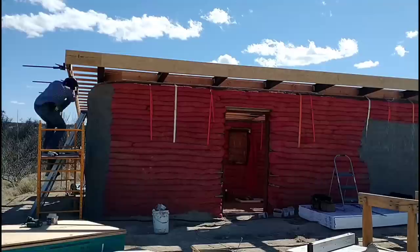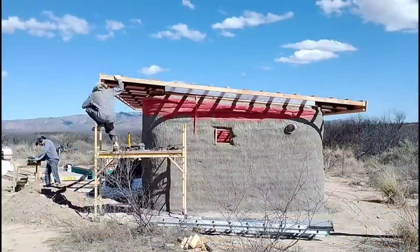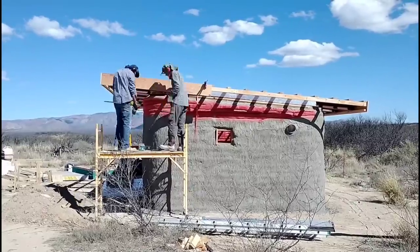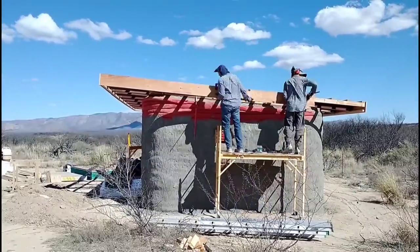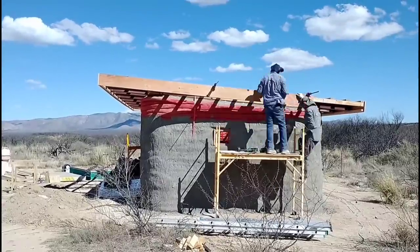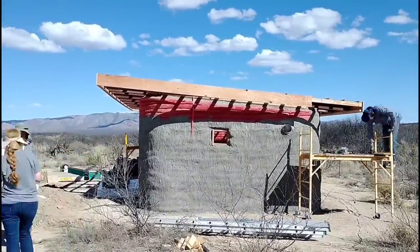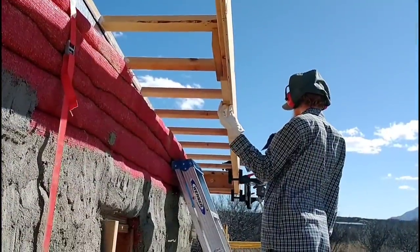We've built a lot of things, but I don't have any formal training in an actual construction job, so we kind of have to figure things out as we go — and sometimes we get it a little bit wrong. These eaves were really tricky because the soffit has to go up over the bag and then under and out. This is a good example of where I hadn't quite thought it through and had to remove it later. Unfortunately, we made the random decision to use staples rather than screws to attach this, and staples are a lot harder to remove than screws. We had to pry these boards out and then get a Sawzall up under there to cut through the staples. It was a pain, but we got through it.